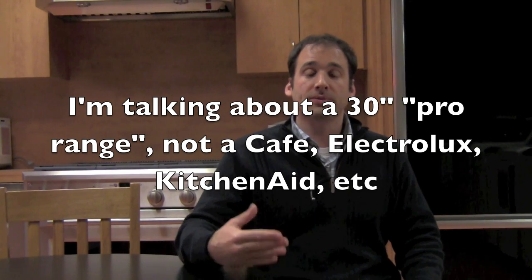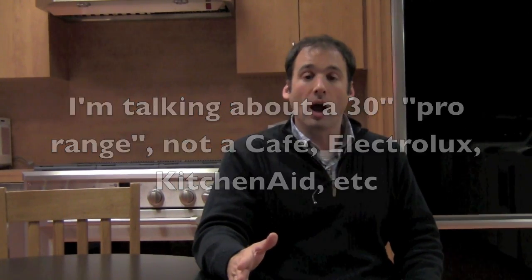I would feel comfortable putting about 600 to 650 CFMs over a 30-inch range. Of course, whether it's really going to be efficient depends on your cooking style. On a 30-inch range, are you going to have all 4 burners cranking, entertaining people, making meals for the whole neighborhood, the whole floor in the building? What kind of food do you cook? Are you doing a lot of wok? Perhaps you're cooking more ethnic dishes with a lot of garlic, a lot of oils. There's going to be a lot of splattering, perhaps a lot of grease.